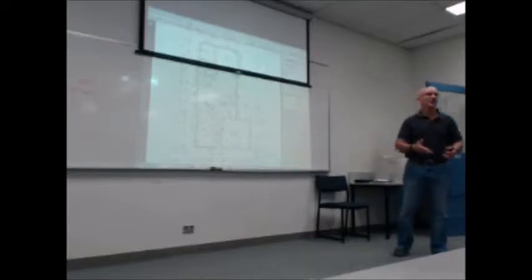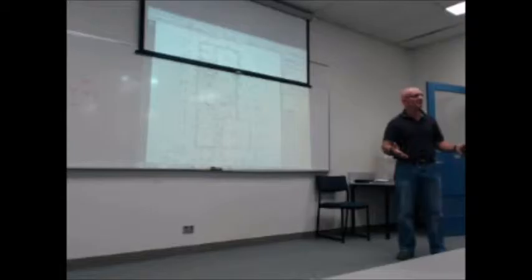It's like when you do the fix. How I used to do my tiles and fix was, I'd do my fix, but I'd only tack my skirtings on. Then I'd pull them off, they're all numbered and named to where they've got to go, put them in a room, tile up to my plasterboard, then I'd put the skirting back on top. Rather than tile into a skirting line. Yeah. I'd have to be as clever with my cuts. Well, that's the whole idea of the skirting board, isn't it? To cover up the joint.